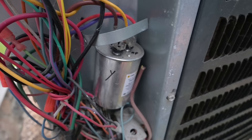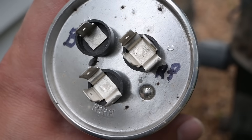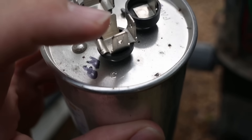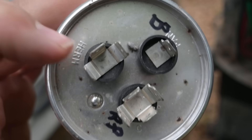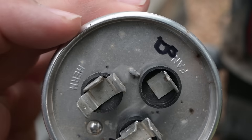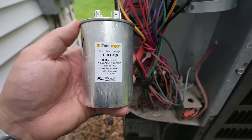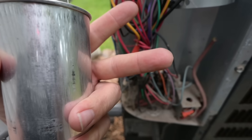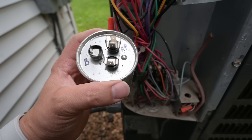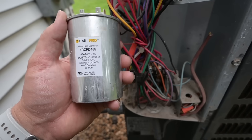We're going to go ahead and disconnect our wires now. Right here on the top of the capacitor you can see the common terminal — that's where our voltage is really coming into our capacitor, and then going out to the compressor and the fan at these two terminals. I'll link to capacitors like this in the description — the most common sizes. I'd recommend picking up two of them if you can; they're not that expensive. These do just kind of randomly fail — this one is probably only about two or three years old and it's gone bad again already.